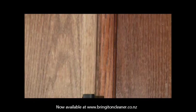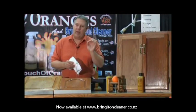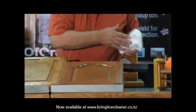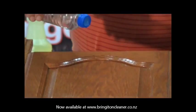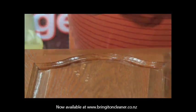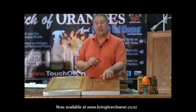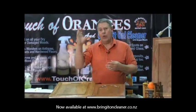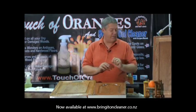When we say overnight application, we normally tell people: put a coat of beeswax on before you go to bed. The next day there's going to be a little film, a little residue — go ahead and wipe that off. And what you're going to find is not only have you brought your wood back to the original color and luster, but more importantly you've actually sealed your wood, waterproofed it, and sunproofed it. We do recommend reapplying the beeswax every six months, especially in areas where you have wood exposed to water, steam, or sunlight — like if you have sun coming through the window in summer and it's hitting your piano, dining room table, or whatever piece of furniture.